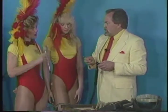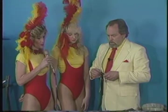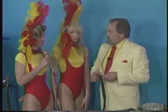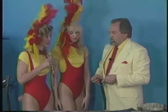the electrode. I'm not changing the holder because I'm using the same. I try to pick things that are like average. Why would you, under what circumstances though, would you want to change it? Well, if I wanted to weld something like 3/8 of an inch thick aluminum plate, I'd have to go something much heavier, right?